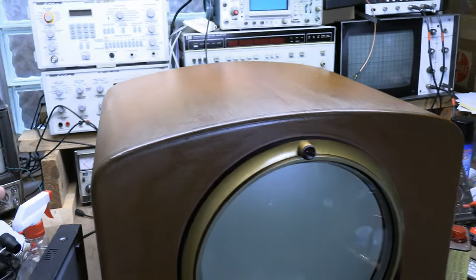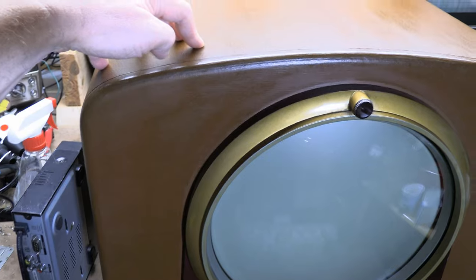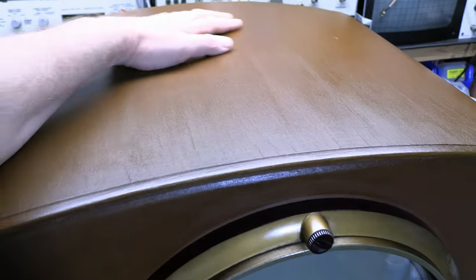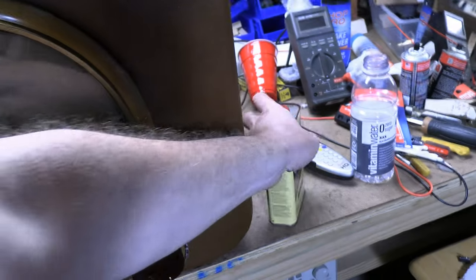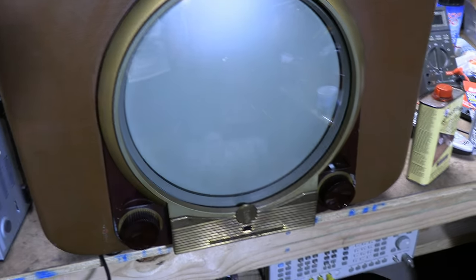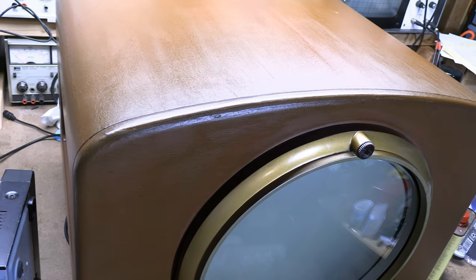That turned out a lot better than I expected. Turns out this stuff isn't quite as fragile as I initially thought — the scouring pad with slight pressure and the Gojo really cleaned it up nicely and got all those paint flecks off. After the deep cleaning I put a little Howard's Restore French Mahogany on it to give a little color back, and finally some Oz cream polish. Cleaned up the glass with glass cleaner. There she is — not too bad for something made around 1949.